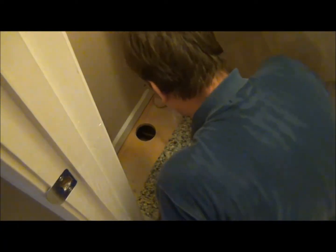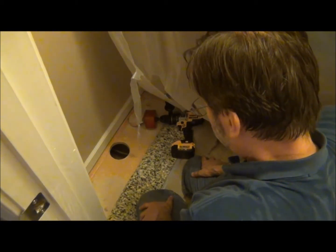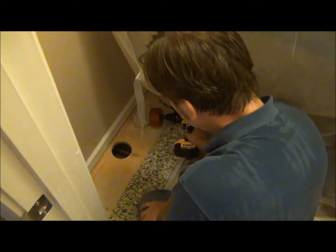We're using two and a half inch tubing for that. He's drilled the pilot holes and now he's drilling the holes themselves out for the upper level. Everything went well — very good. Now I'm going to have to decide if I want to punch a little hole through here to see where I am downstairs, because otherwise I'm going to pop a hole through downstairs where I want to be. This is why you use the coat hanger — you take a coat hanger and a mirror to see how that lines up.